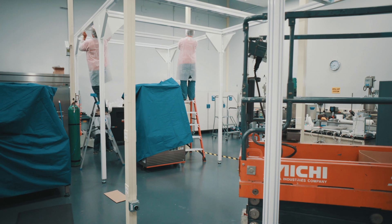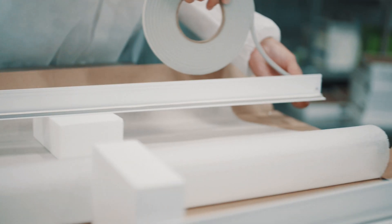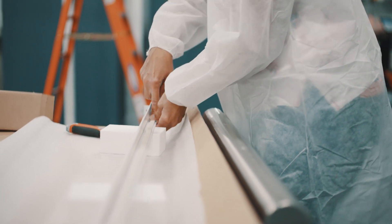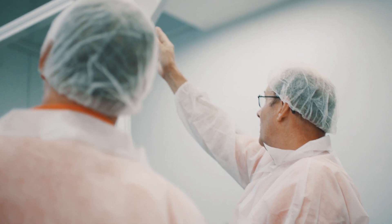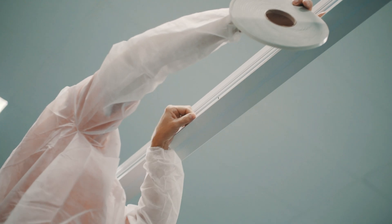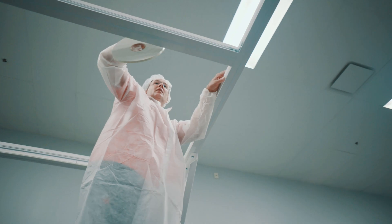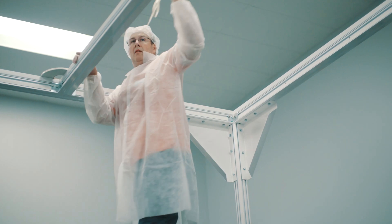After the T-grid is on the extrusions, both the grid and the extrusion have to be gasketed to create an airtight seal, so dirty air doesn't enter the space when the HEPA filters and lights are attached. Put the HEPA filters up first as they are the largest and heaviest ceiling item. Attach the gasket at the center point of the grid's L-shape. Don't stretch it — lay it out with the paper on, stretch it across, then pull the paper off after each section is gasketed.